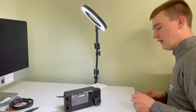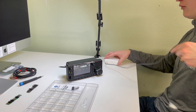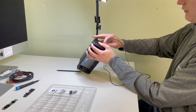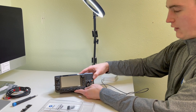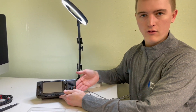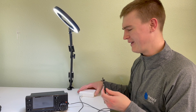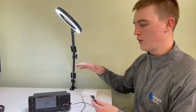Let's go ahead and test it out. I have my MacBook charger here — just plug the USB-C cable in, open up the little flap, plug it in. If we turn the radio off, we can see we get the orange charging light. It's just a connector swap — we're not adding USB-C Power Delivery standard, but we do have the correct resistors so that if you plug it into a 20-volt charger like this, it sends the correct five volts at about 1.5 amps. The charger knows what kind of power to send.